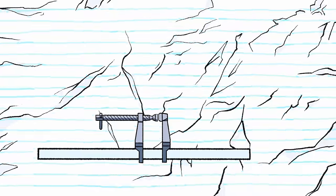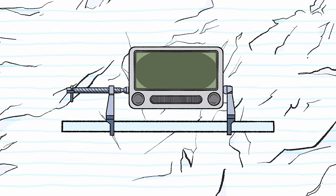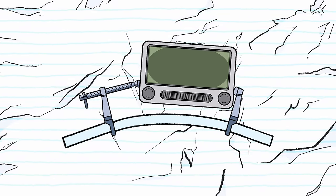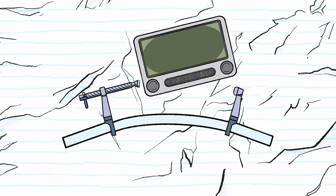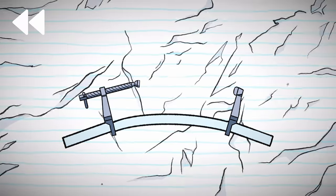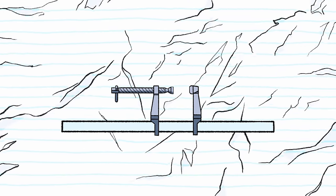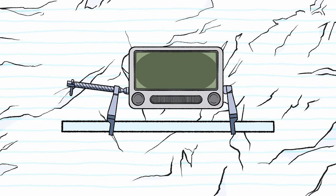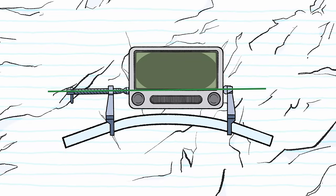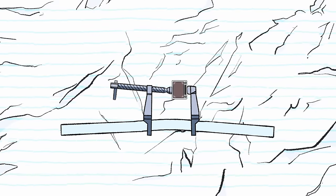One thing that you'll notice when using a bar clamp is that the tube will bend under load. The longer the bar, the more it will deflect. The problem with the bending bar is that the spindle will actually start to get out of alignment. This is bad because the part can slip out of the clamp. To keep the spindle in alignment when the bar bends, I've calculated and installed a preload angle into the arm that will keep the spindle straighter when the bar bends. The angle of the arm needs to keep the spindle straight, within an acceptable range when the tube is short or long.